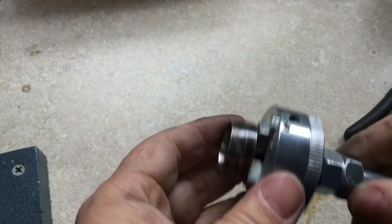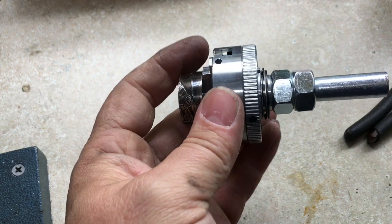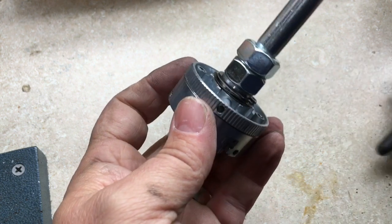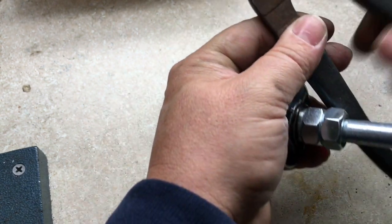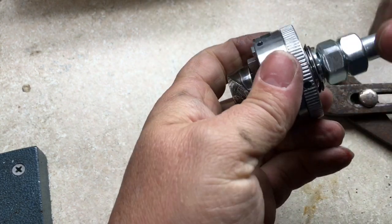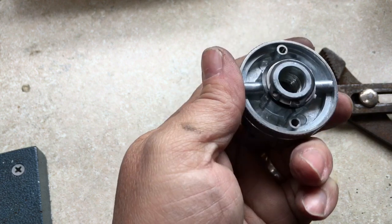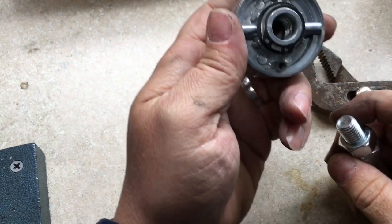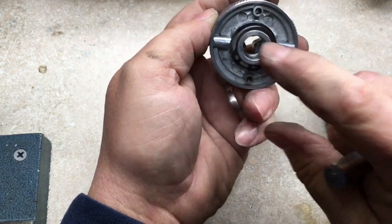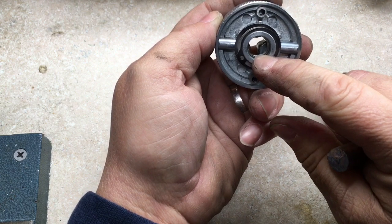Let me tell you how I made this. I bought it on Amazon — the link is in my description down below. It's going to have a different size thread on the inside; it's actually a really fine machinist thread — a 12mm by 1.0 thread pitch. You're going to have a hard time finding that, so what you do is buy an M12 by 1.75 tap.